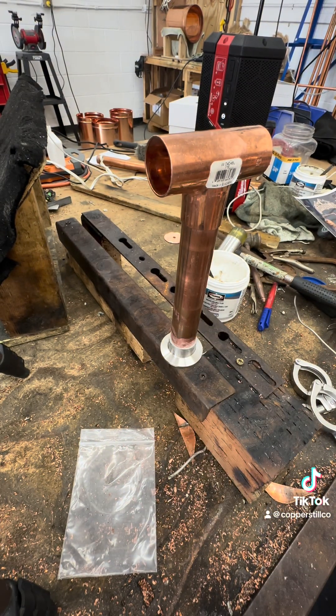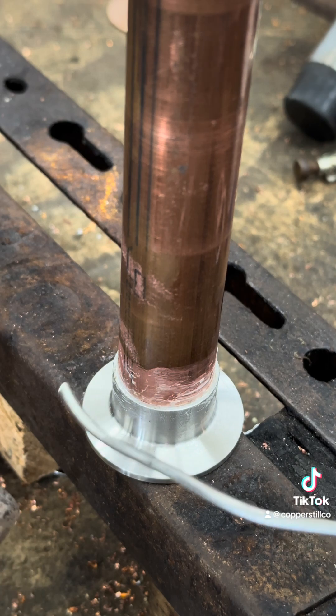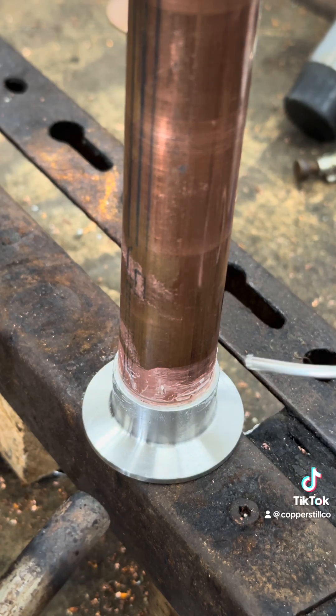Let me just go through this real quick. You want to clean your pipe with a wire brush or something to that effect, flux the components, assemble it, and get it to this point. I've already cleaned the pipe and done what I've needed. So this is how I'd show a beginner. First, focus your heat more on the pipe — the goal is to just put a bead of solder on the pipe itself.